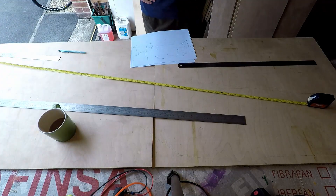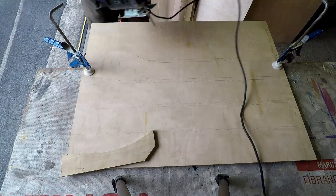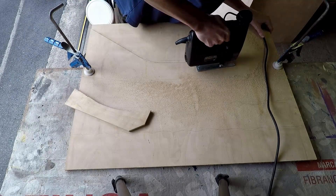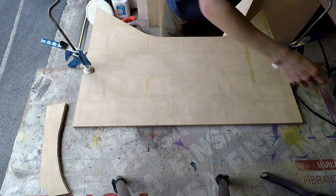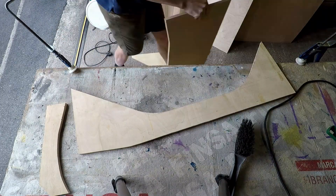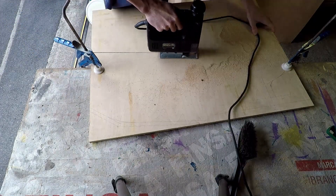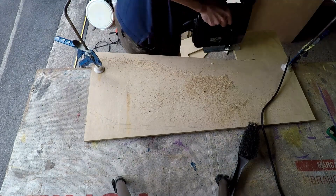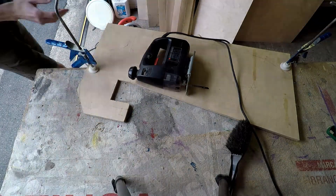Now I'm starting to mark out some of the pieces for the body. These bits are relatively thin 6mm birch ply and these will form part of the sheathing for the rear section of the body — the box section leading up to the seatstays and the chainstays. Using my trusty Black & Decker jigsaw. This is now the front section of the frame or the body — this is 15mm ply so it's quite thick.